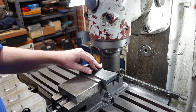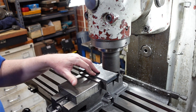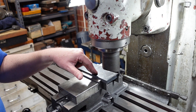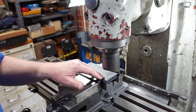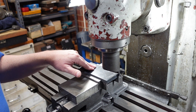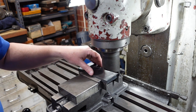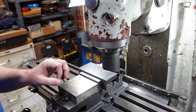We'll have to see. The other thing I'm doing here — I've got a fly cutter out. Normally I don't use fly cutters because they're a bit slow, but when cutting plastic you want a reasonably high feed rate, otherwise it tends to fluff on you. So I can use a fly cutter with the feed rate set reasonably high, take a few shallow cuts perhaps, but fingers crossed that should give me a reasonable finish without bowing it — not too much tool pressure, all that sort of fun stuff.